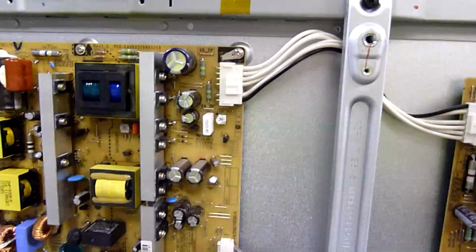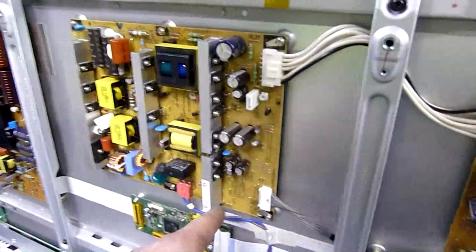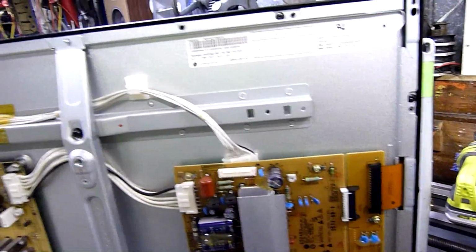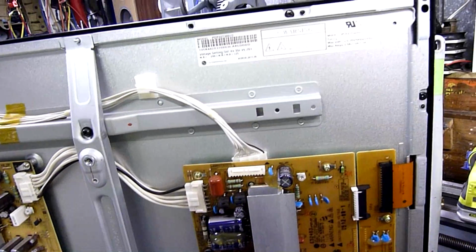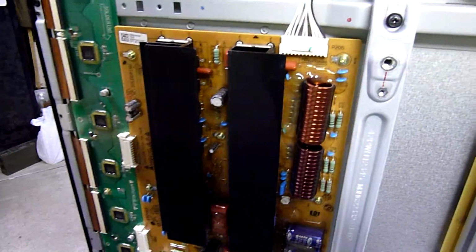Okay, well, with the Ysus board disconnected, VA, VS and 5 volt are all fine. They're all within point something of a volt of their rated tolerance that's marked down on the board. That's with the board disconnected. It won't stay up long enough to get an accurate reading with the board connected though. So I'm guessing you got to get troubleshooting in there or just replace the board.